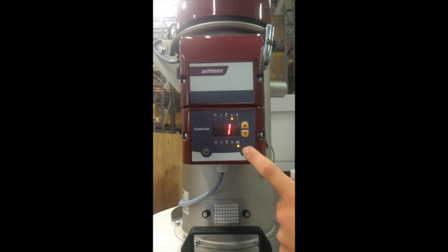Dosing changes can be adjusted within menu 5. Like menu 4, dosing changes can only be set if a dosing valve is available. It is possible to set the number of feed changes from material A to material B. We recommend customers get this optional attachment, because material B is only dosed if the material B sensor identifies the presence of material. If there is no material B, then only material A will be supplied.